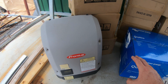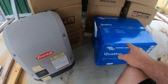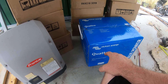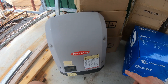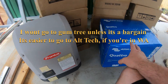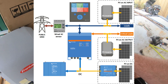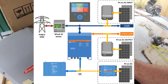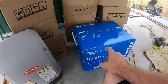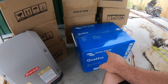Not recommended by Victron because of the limited voltage, but it will work. We've got 3 kilowatts worth of solar panels on the MPPTs which are supposed to go into the caravan, but I want to test this. So we're going to run the MPPTs with 3 kilowatts worth of panels, and I'll get another additional 3 kilowatts worth of panels out of Gumtree and attach this to it. That means in total there's 6 kilowatts on the house — 6 behind the Quattro: 3 AC coupled with the Fronius inverter, 3 on the Victron MPPTs. The other 6 is out of band, on the house. So we install a smart meter on the house — it'll see the power going to the grid and the Victron will know it can pull extra power to charge the batteries.